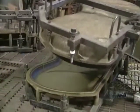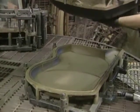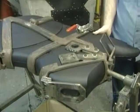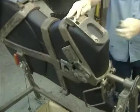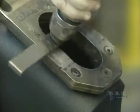The mold cover is lifted off and the plastic piece is unmolded. Gloves must be worn since the piece and the mold are still very hot. Here they fabricate a mechanism cover for a stationary bicycle. It's held in place by a cutting pattern, and openings are cut with a pneumatic tool.